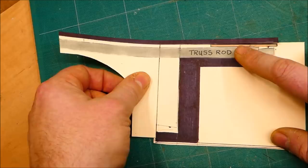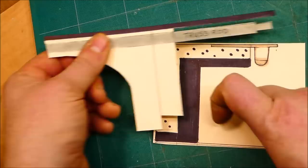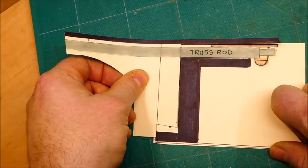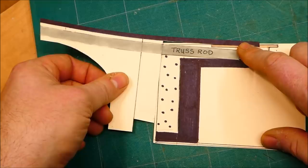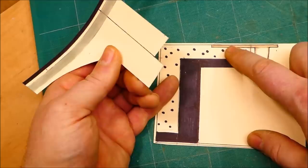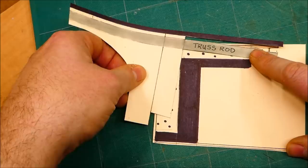The other thing is, when it comes time after you've done your neck reset, you've reduced the heel. That makes the dovetail tenon loose in its pocket, and we have to shim it out, either putting shims in the pocket itself or building out what we call the cheeks or the sides of the dovetail, gluing shims onto those. Then we can sneak up to a perfect fit where things lock in place. When it comes time to do that, if you overbuild it any, there is not enough room to get that truss rod underneath there, the fingerboard on top, and tip it down into place. You'd end up breaking the wood again. You can't lift this high enough. So you're basically forced to cut back some of this soundboard material here over top of that channel. And that way you can get in there, get the truss rod through that front brace, and then tip it down and have it come into position where it has to stay.